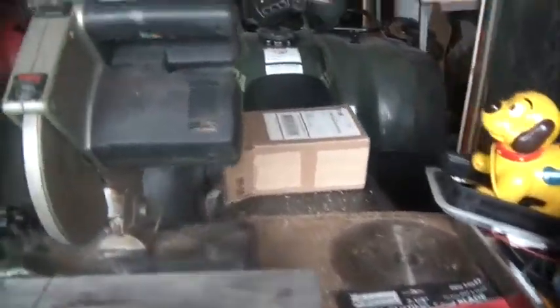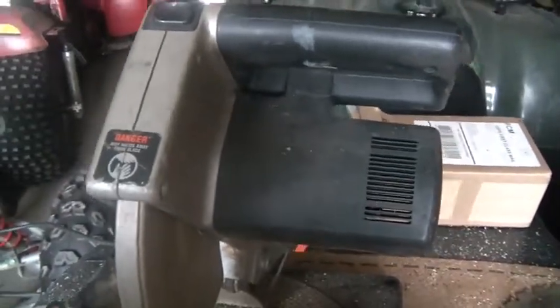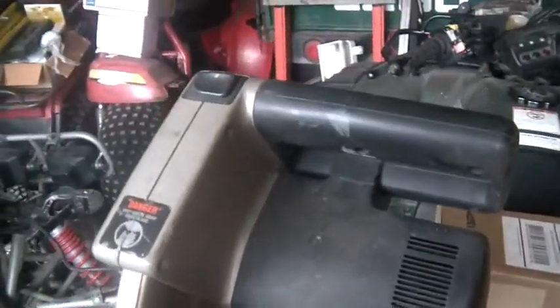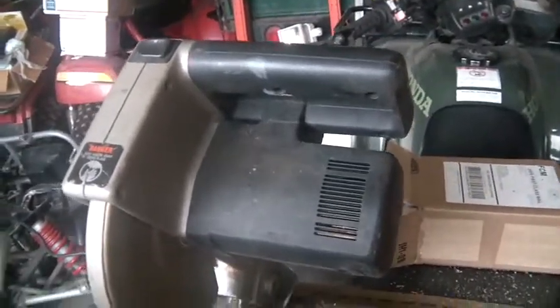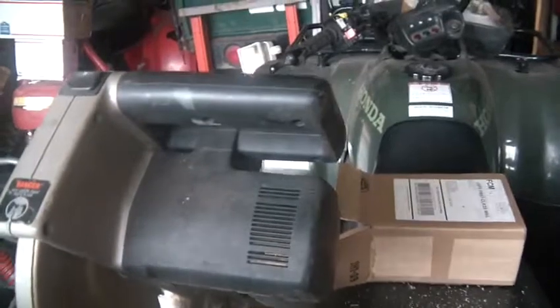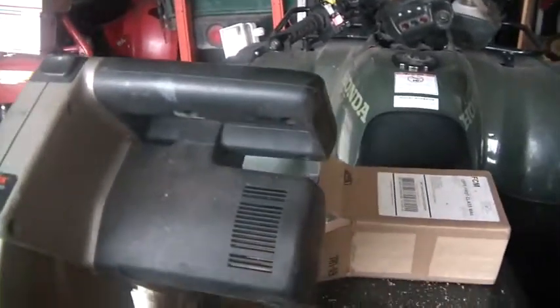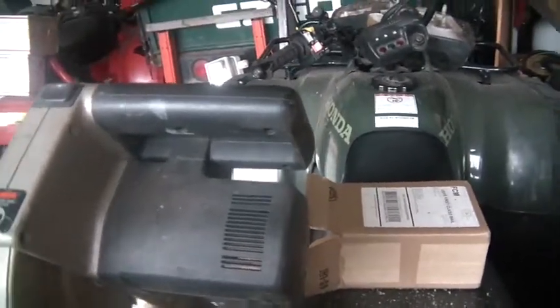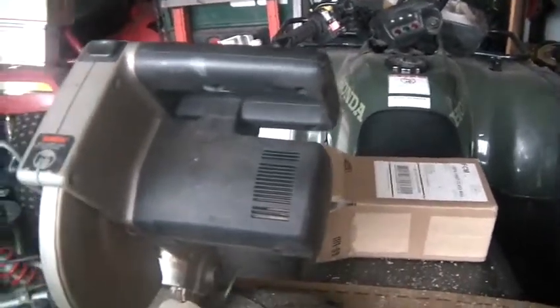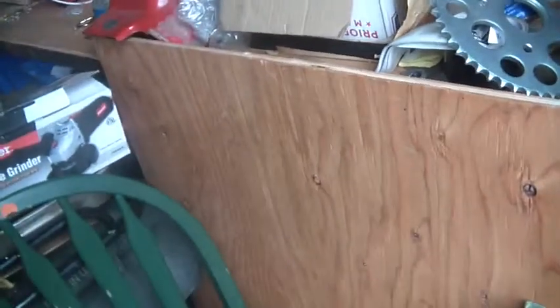Also, there's a big difference between turning at 3,600 RPM or 5,800, whatever the spec is, and turning at 10,000 RPM should it start flying apart, right? The particle that hits you has energy of mass times velocity squared. So you start really spinning them up, should something get loose and get into your body, it's going to hurt all that more.